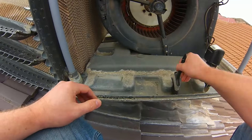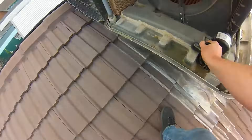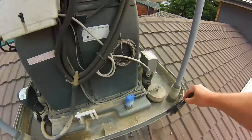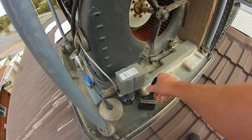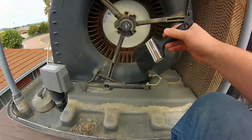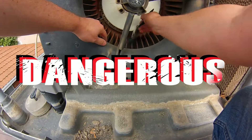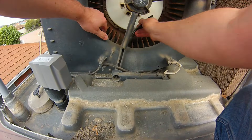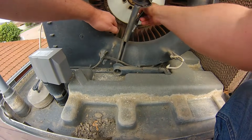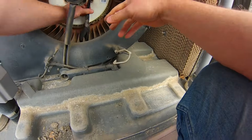If you don't do it for a few years you get really heavy build-up everywhere. This unit has a little bit, so we'll run some descaler or use a wire brush to get rid of it. It is very important when working on your aircon that you isolate the power, especially when cleaning inside the fan. The blades do get dust build-up and each individual blade will need a brush down to keep it in balance.